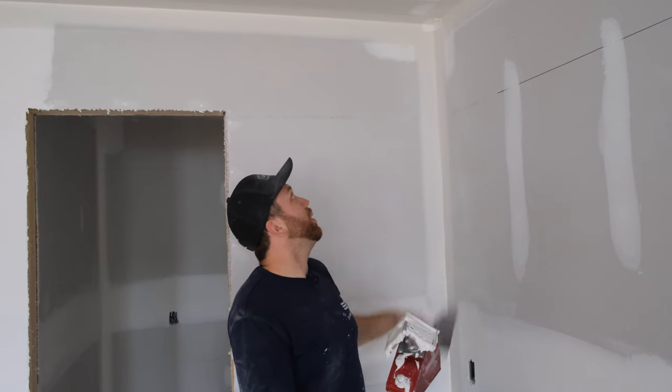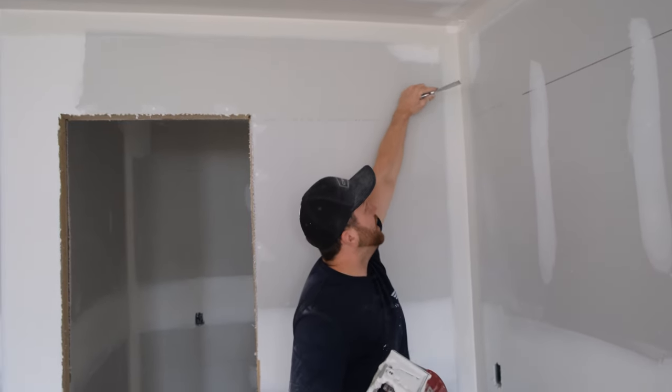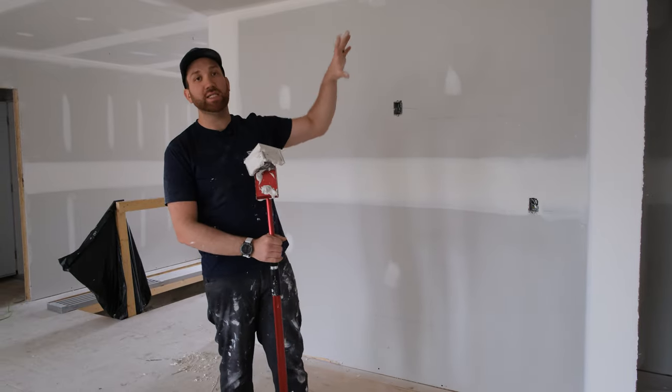When you first put that box into the corner and start to push, thin mud is going to overlap over the back of the blade and result in more drag. This is a pretty minor drag example — only about three inches, easy to hide when I touch up the three-way. But if my mud was any thinner that drag could be like eight inches down the wall. Having a little bit thicker mud results in less drag. If you're getting heavy drag, try thickening your mud a bit.